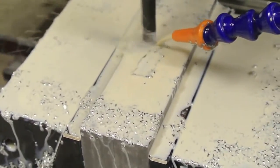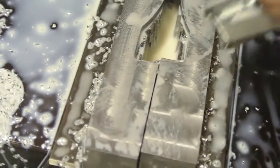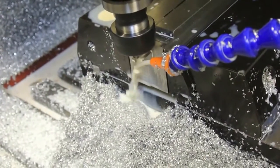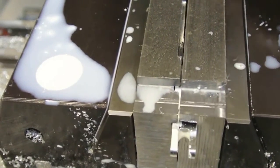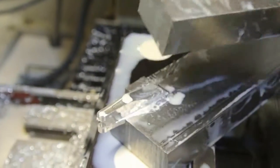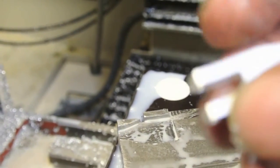We're just coming to the end of the final cut now, holding the work. There needs a bit of movement on the jaw. There you can see how close a fit it is — obviously you have to clean it up every time. I reference it against the back of the jaw here each time, and it works well. So here you see the cutting of the slots, the fixture being used. Slacking off the vise, moving the packing pieces from the back jaw. And there you see the jig and fixture — it's working very well. As you can see, the slot is nicely cut, nice and even.